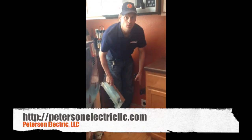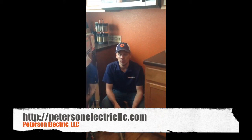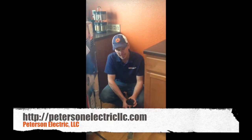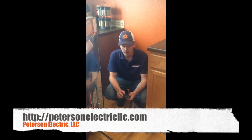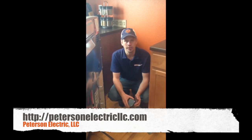There are so many times I go to homes and there are open splices in walls, especially in basements, and we cannot service it that way. We have to find a way to junction those connections and service them if something goes wrong. She had a GE breaker — I'm not going to say anything bad about GE — but let's just say I put in Siemens and Square D QO for a reason.